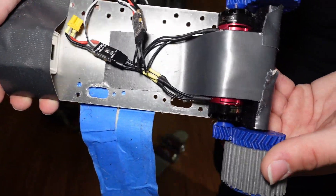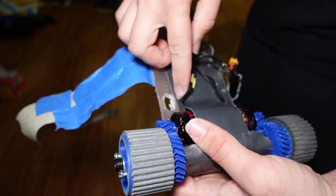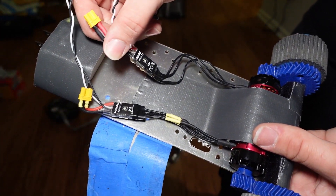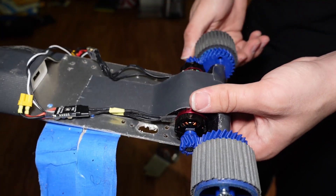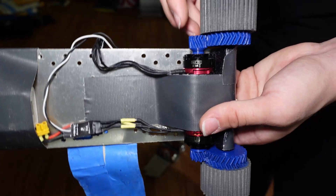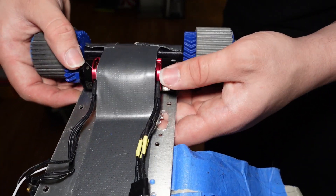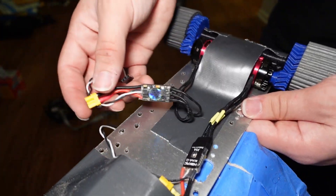For a closer look at the drive test bed — this is literally an old version of Division's base plate that I cut on a ShopBot CNC router, which is not meant for cutting aluminum. You can see it melted the aluminum in places, making it basically unusable as a robot plate. I have two HackRC BL-Heli 32 35-amp speed controllers — the same ones on the saw and the same motors on both drive and saw. The drone motors come with left-hand threaded nuts, but since they're aluminum I was able to file off the flange. One motor is left-hand threaded and the other right-hand threaded, so they spin in opposite directions relative to the motor but the same direction relative to the wheels.